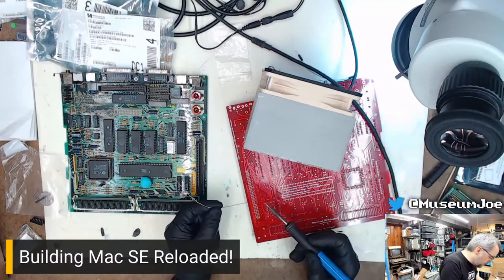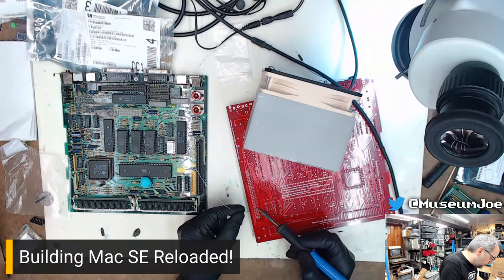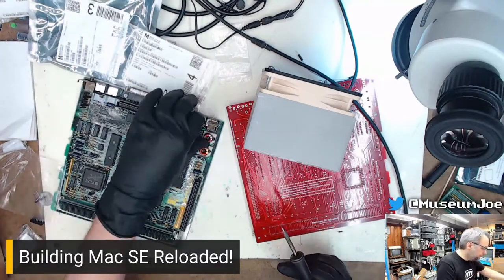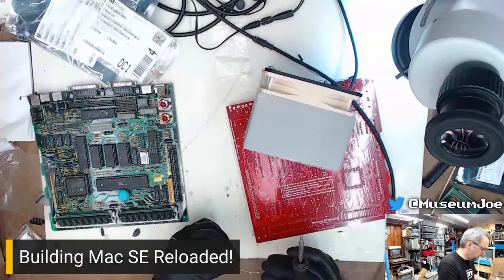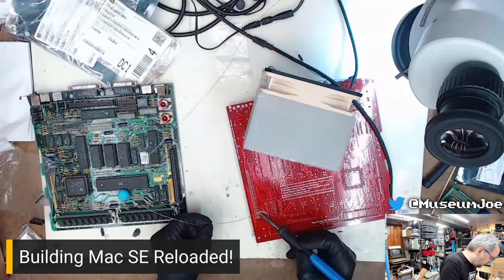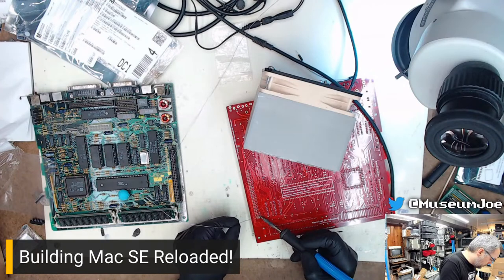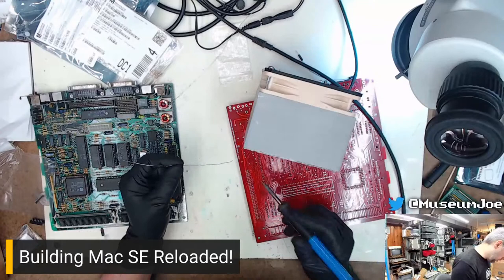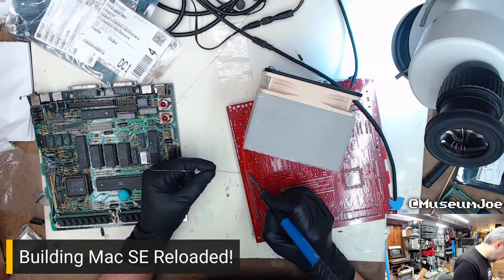Every once in a while, you'll see me duck over here to clean the iron. The iron can get a little bit oxidized solder on it, which can cause problems. But also, it just gets this buildup of crusty flux, because it basically burns a little bit of the flux every time you put it on there. And that can just cause glooping and soldering glitches and problems. So, pardon me while I get a weird angle to solder this on here.